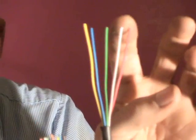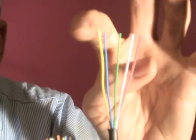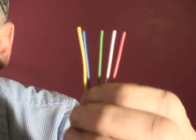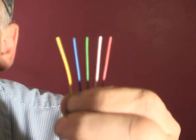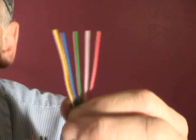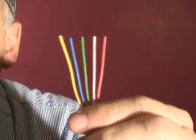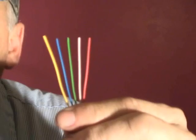Hello my viewers. Right now I want to show you some things about thermostat wire. Here's a five conductor set of thermostat wire. You have the red, white, green, blue, and yellow. Now usually this is only going to be used like if you have a straight cool air conditioning system or maybe just a furnace without any kind of air conditioning at all.